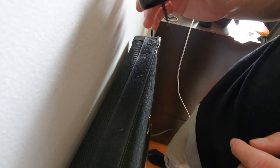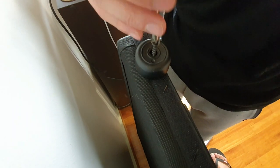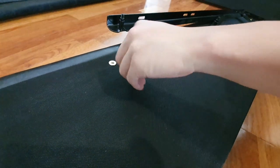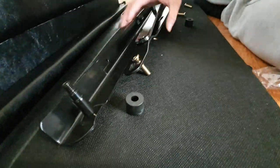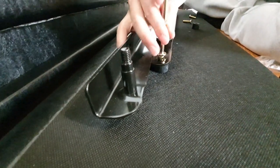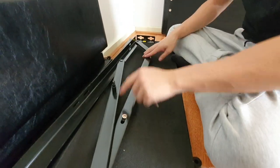For the second part, we have the foot that we're going to attach to that board, and there's a white marking that they've placed on both sides — that's what we have to attach here, so you just have to screw that in. For step two, we're going to remove this off and turn it so it's just about 12 millimeters out. What we do is we have the plastic washers and we place those on top, and the screw will fit nicely in there, then we fold it in.